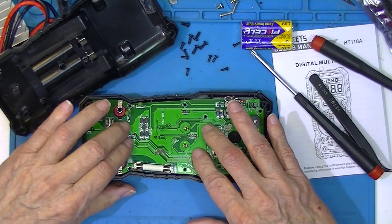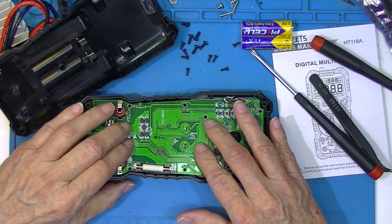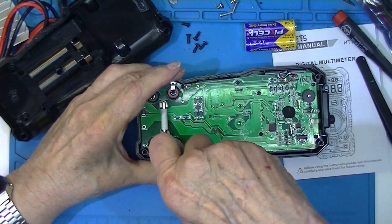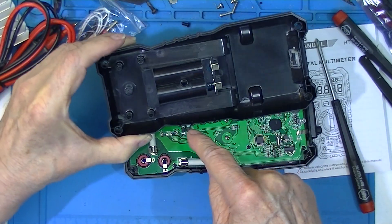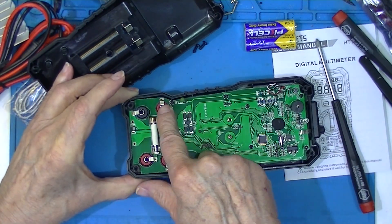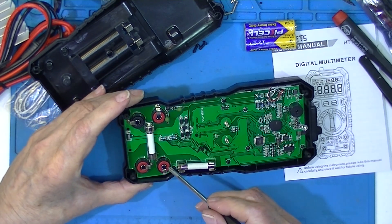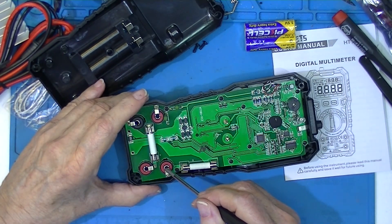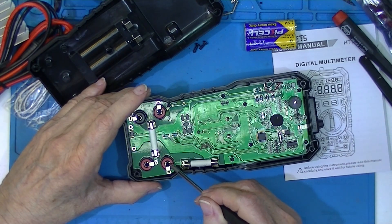It's a little bit springy, but that's because we're compressing the silicon bronze contacts on the switch. These four posts, when inverted, supposedly hold these in position. They're not tubes and they're not soldered — they're just half circles. They fit more snugly in the plastic, but they might loosen up over time because they're just a wrap.